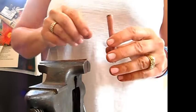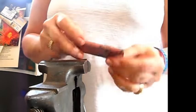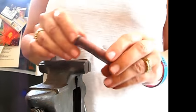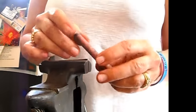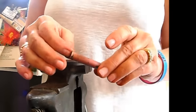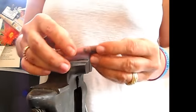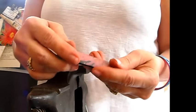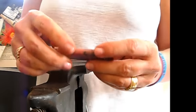I'm going to show you how I do the chasing on some of my jewelry. This is a sheet of 24 gauge copper that I have annealed, which means I've heated it up to a temperature where it softens and becomes more malleable. I was actually able to just bend this sheet over with my fingers with a little effort.